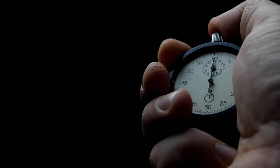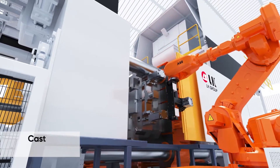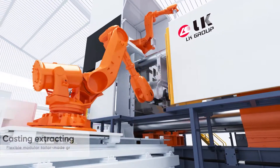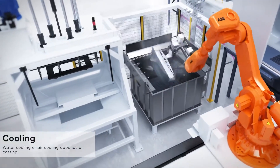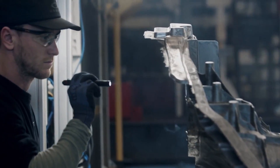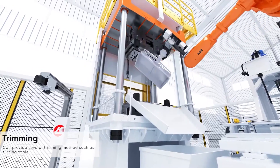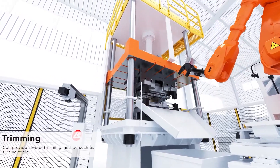This action takes less than one second to complete. The clamp releases the two halves of the mold, and a robot picks up the casted section, which has now cooled to 750 degrees Fahrenheit. Then the part goes into a water bath to bring it down to a reasonable temperature. Finally, the excess material is trimmed from the casting and is X-ray checked for quality. Then, lastly, there is a final machining phase that adds fine details like threading for fasteners.